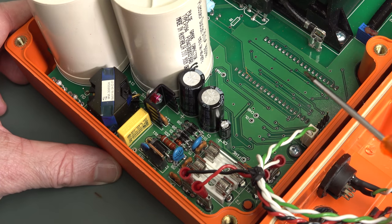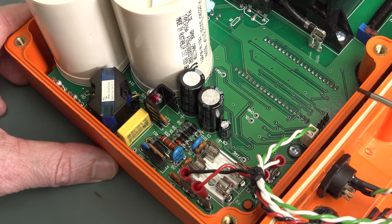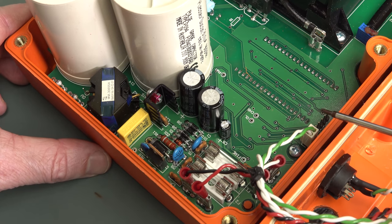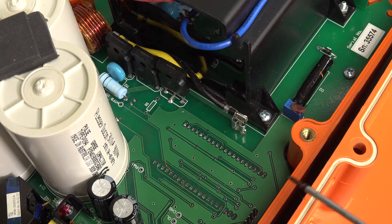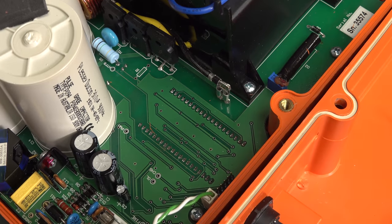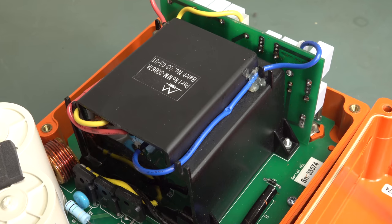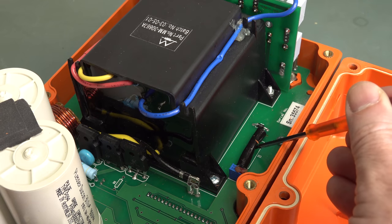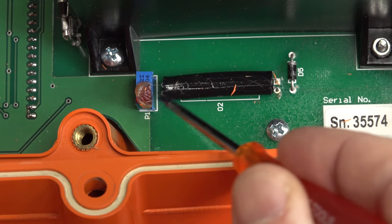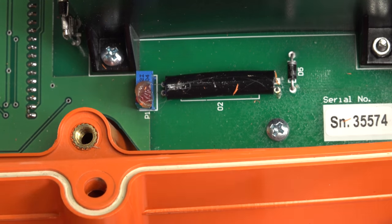It looks like a pretty dumb unit — there's no smarts in here. I'd say the kilovolt meter is just like a panel meter type thing, because I don't see any microcontroller unless something's on the other side. Maybe we can take the board out and flip it over. I think we've just got the primary side, storage, and switching in here. Looks like we've got three big MOSFETs in there that switch this huge custom transformer. And marked D-O2 down there — it's got a cover on it with two leads on each side. It's an optocoupler!